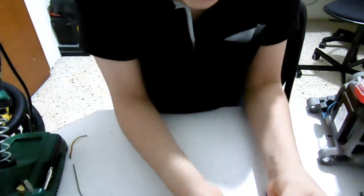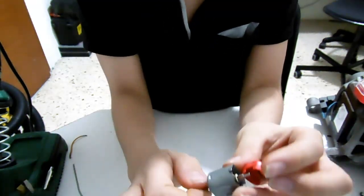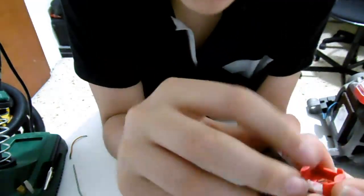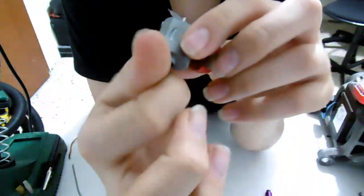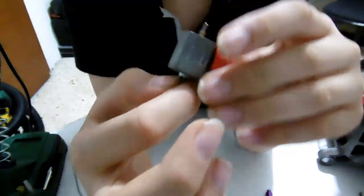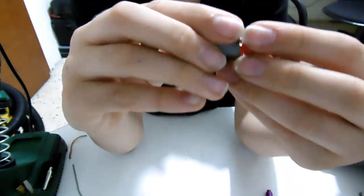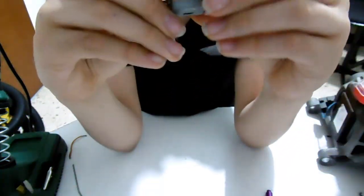When I put this setup together and apply power to it, the brushes supply power to the armature, and because the armature has a changing magnetic field, this makes the magnetic flux turn the armature winding. Thus, the motor will operate. I'll just have to be careful not to give too much voltage, or things won't end well.